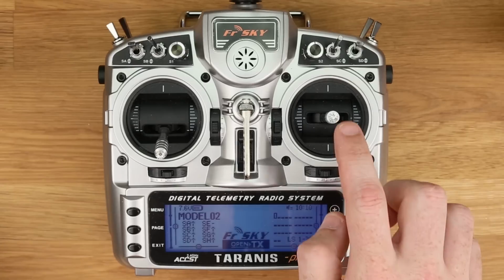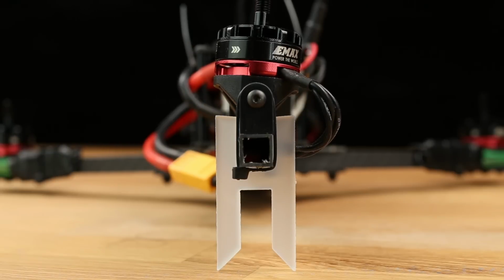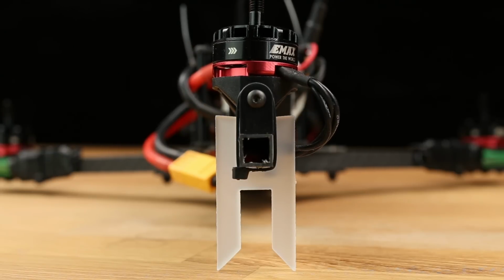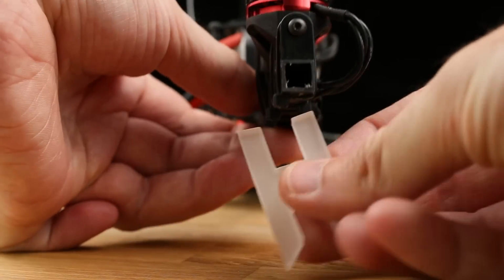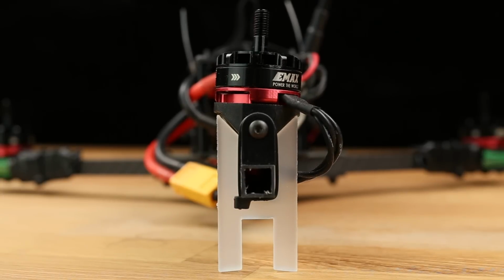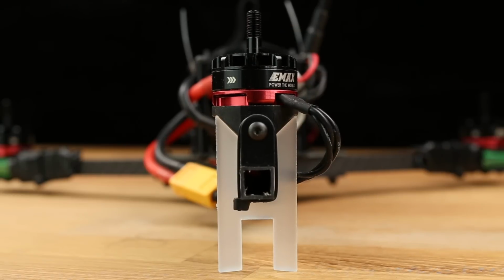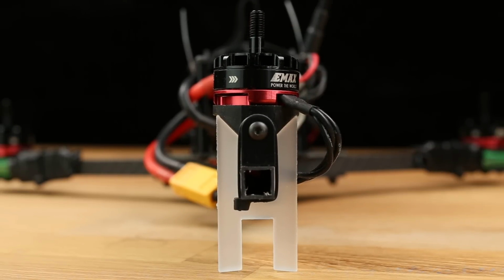Now it's time for the vertical position, so move the elevator stick upwards. Loosely adjust it and then flip the servo setup tool around. Adjust the angle until the motor is perfectly level. This can be a bit tricky, but if you use the servo setup tool and look at something flat on the copter, like the top tray on the mini tricopter, you're going to figure it out.